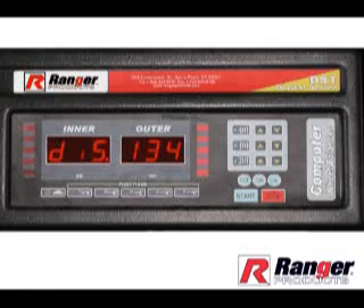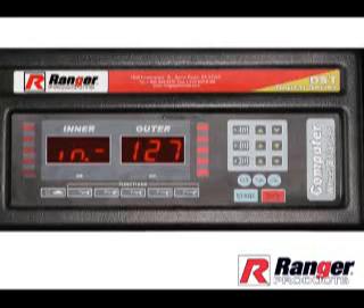Proceed directly to the IN setting by following the next procedure. After checking or properly adjusting the DIS setting, press the A up arrow twice. At this time, IN-XXX will be shown on the display panel. XXX represents data already entered; actual number may vary. To adjust the IN setting, use the B up or down arrows. Note: the IN setting uses positive or negative readings. The numbers continually rotate around the clock using the B up or down arrows. For example, IN-XXX is a negative number setting.